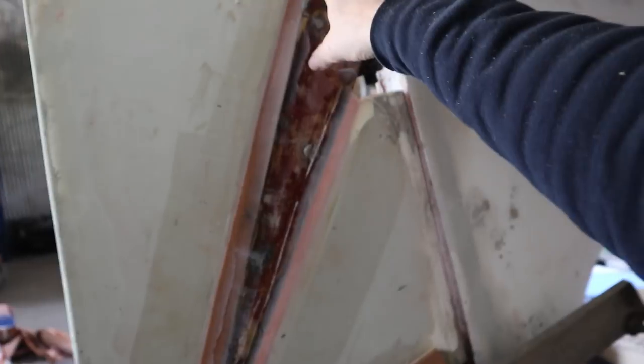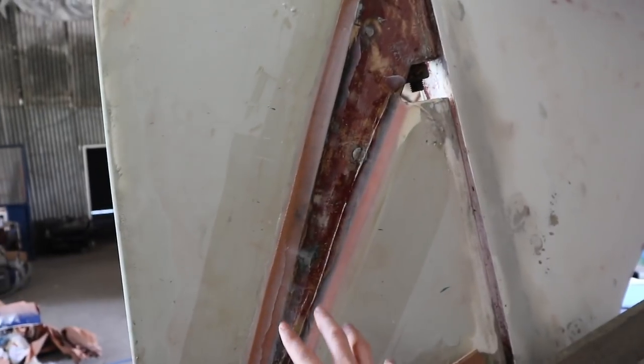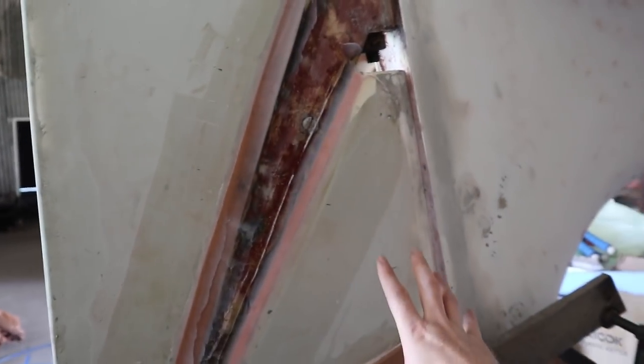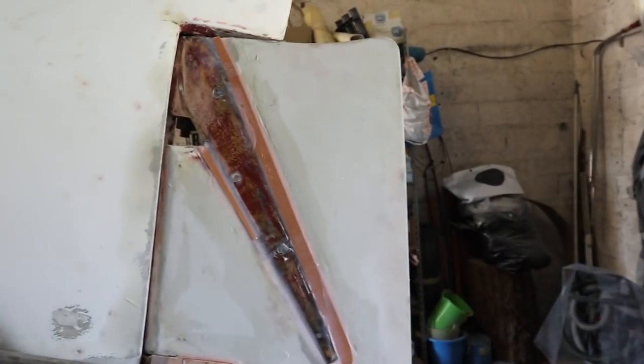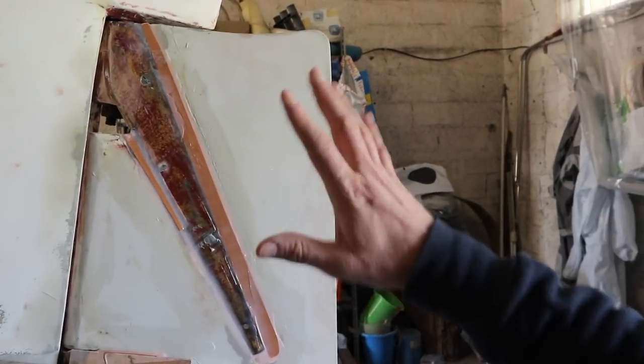So I use some PVC to fill the gap and avoid having too much epoxy putty, so it's more flexible and stronger. And now I wait for it to cure. After that, I will sand everything here, and after that I start to put the new putty all over the rudder. But at the moment, this is what I did today and just finished now.